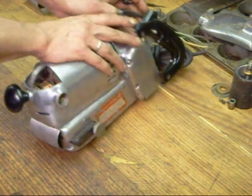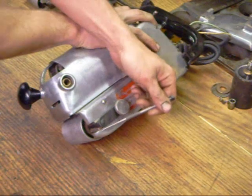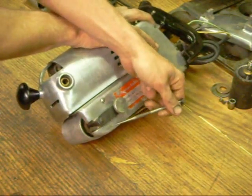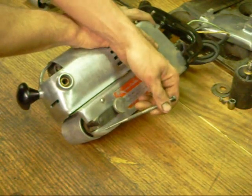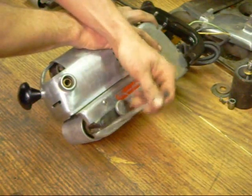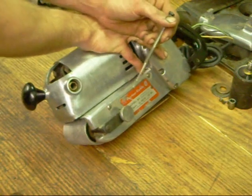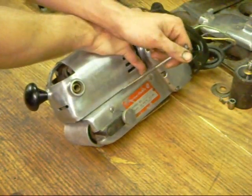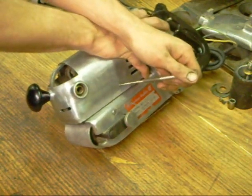There is also this lower boss right here. Often, on a sander that's been dropped or banged around considerably, this lower boss will be snapped off. Without this boss, there is nothing to keep the arm from rocking, because the boss's faces are what actually keep the tracking arm in the same plane with the platen. That is a far more serious condition than the roller being bent.